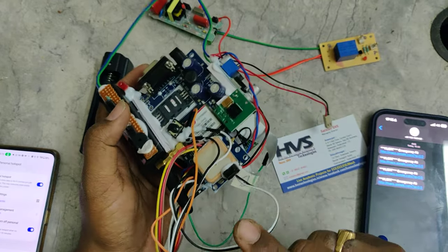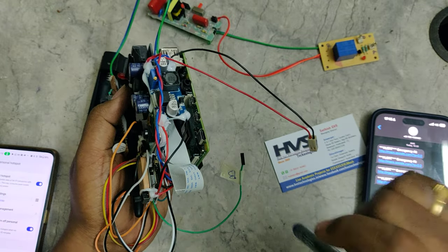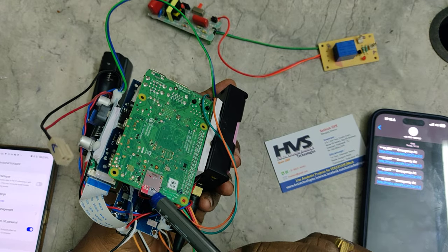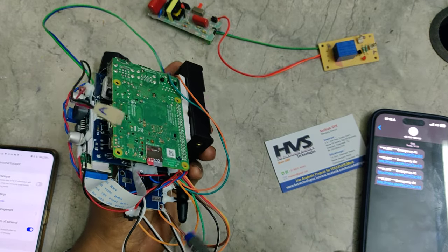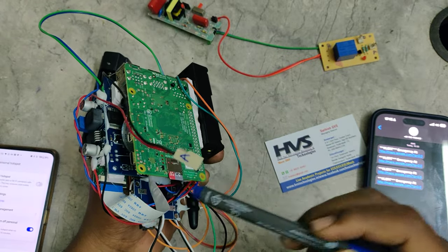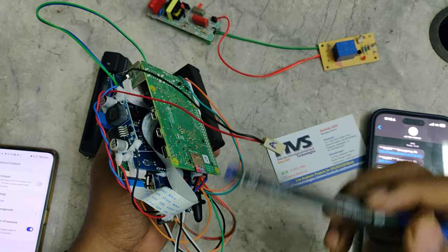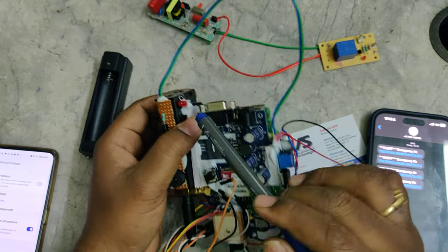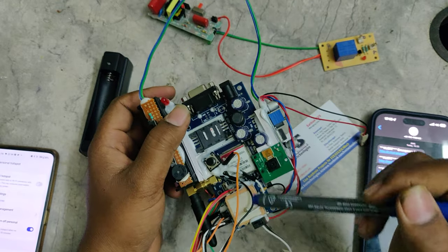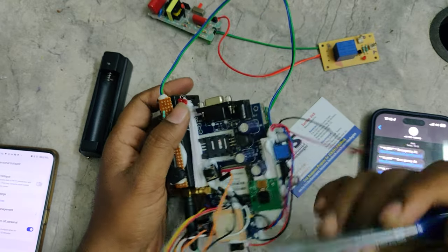When the system is switched on, the Raspberry Pi takes 20 to 30 seconds to boot the operating system loaded inside the memory card. We have coded the instructions inside this memory card using Python language, which will execute step by step. Once the OS boots successfully, the first step is the LED will turn on and off two times, then it will initialize a setup connection between the GPS and GSM modules.